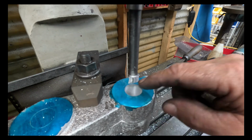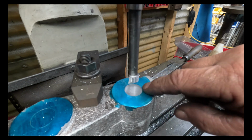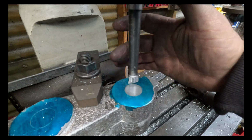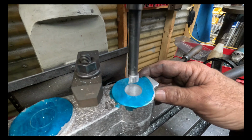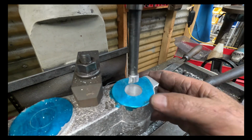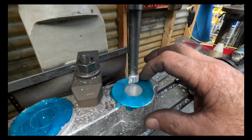Basically at the moment, I'm probably ripping out about 4 to 5 mil out of the diameter at a time. And that's actually cooled down, which is a good sign, which means the tool's nice and sharp and cutting well. So I'm just going to try that tiny little micron cut and see how the surface finish comes up, because I'd much rather find out now before I get close to size.